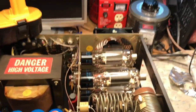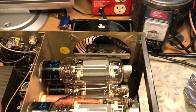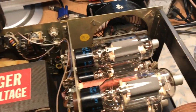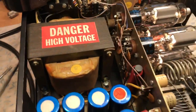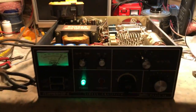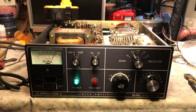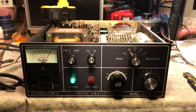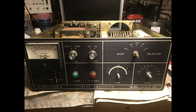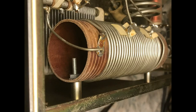What I did was I reversed the fan — I don't know if this is the original fan — but I reversed it so it's sucking the hot air out, and I put a small squirrel cage on the back. That's a 110 fan, and it seems pretty quiet. And that's basically it — looks like we got a really nice, good start with no shorts. This is N2LEN, best 73 with the Dentron Clipperton L complete rebuild.